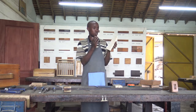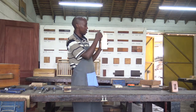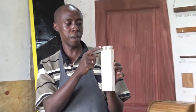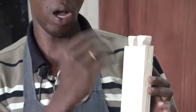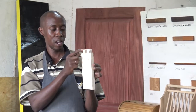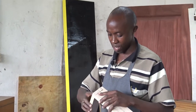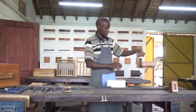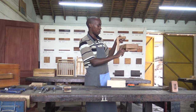The tail is not going to be too slim and not going to be too wide. Remember, the strength of timber is in the grains. If the grains are running this way and we cut them a lot, we make the end of that tail weak. So we have to get a formula of cutting a slant surface in such a way that we don't compromise the strength, and we give the joint a good chance to fit tightly. This one is just rough cut, but once we cut it well, it will form a very good joint which will show smart on this side as well as this side.